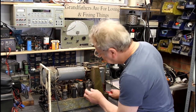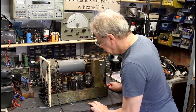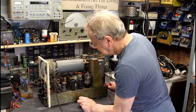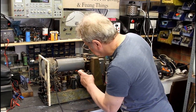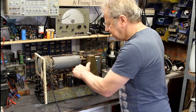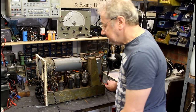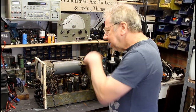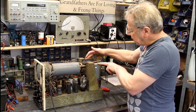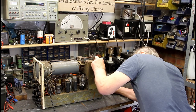There's something actually sort of melted on this rectifier - this is the high voltage rectifier which powers the tube - something melted on it, like wax or bitumen or rubber. It's absolutely loaded with caps to get it working properly; all these electrolytics would have to be replaced especially after that age. We've got two caps on this side which are the oil-filled type, probably to do with smoothing.